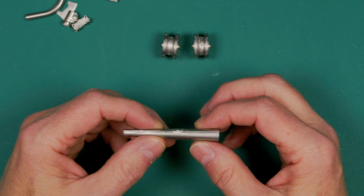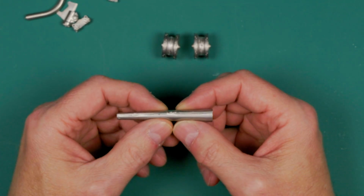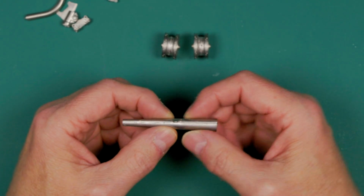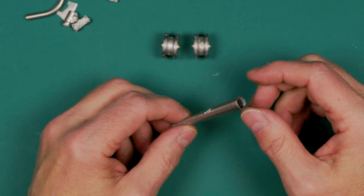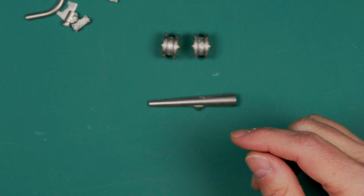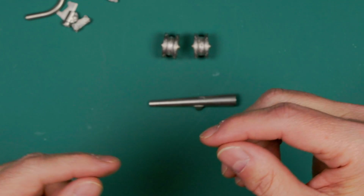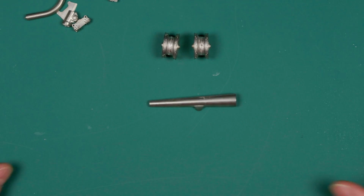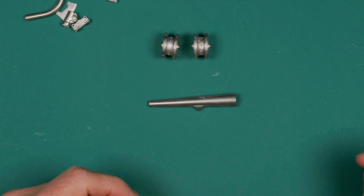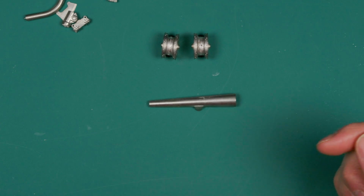Mating surfaces do that. And then the next thing, which I don't have out on the bench, is you'll want something to hold your parts together. So clamps of some sort to hold the two parts together if possible. You can't always do that, like little tiny parts of a bracket or whatever, but if it's located well and it's got a tight joint and it's clean, that's the recipe for success.